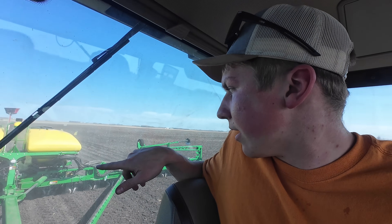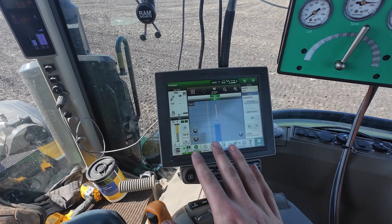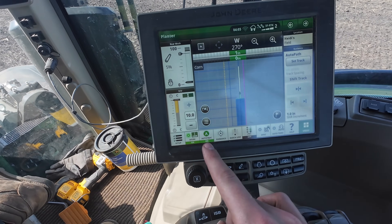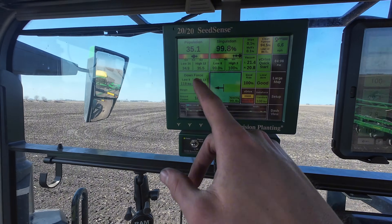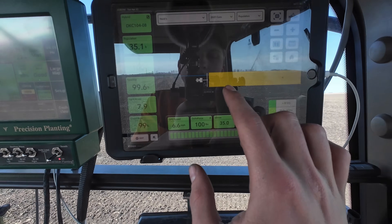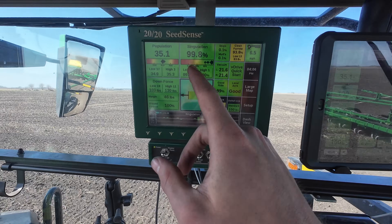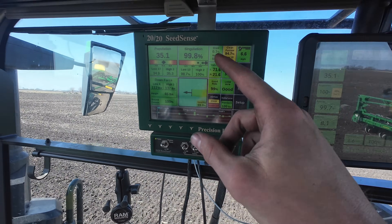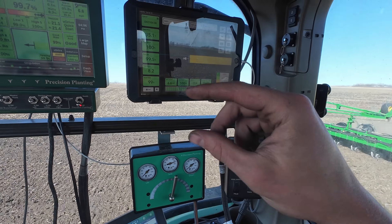When the planters are actually planting, I'm monitoring a couple of things. Number one, I'm looking out the back window making sure none of the row cleaners — those little aluminum pieces — are getting plugged or creating a big furrow in front of the planter. I'm also monitoring all of our displays, making sure I'm using GPS so the tractor will drive itself. On the Precision 2020, my planting population is currently 35,000, and each individual pixel is an individual row — so if one row gets plugged or stops, I'll see it on this screen. I'm also always monitoring the singulation: how accurate the planter is actually planting, using a little sensor in each individual row where all the kernels get dropped to the ground.